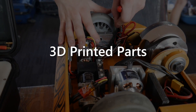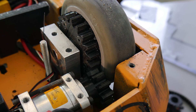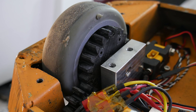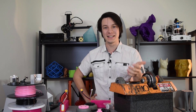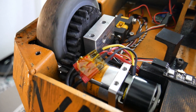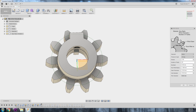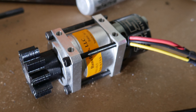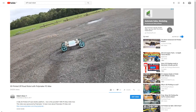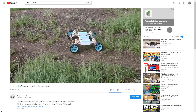But what about 3D printed parts? To really put them to the test, I made these. The robot uses 4-inch wheels, which I didn't want to hang directly off the gearboxes since they're expensive and could get damaged, so I printed these really fat spur gears to allow a small additional reduction and drive them off the gearbox to the wheels. The spur gears were modeled using Fusion 360's built-in gear generator script, and they're printed from Polymaker PC Max, which I tested in my 3D printed off-road platform a few months ago. During testing I realized it might actually work for the violent demands of a combat robot, so I decided to give it a shot.